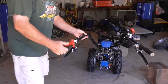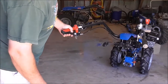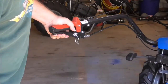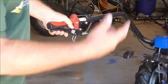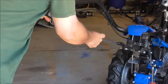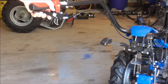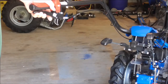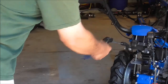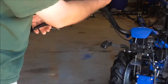Looking at some of the other controls — this is our clutch. In order to perform certain functions on your walk-behind tractor, you've got to utilize your clutch. Such functions would be changing your ground speeds. We have three ground speeds on this particular model. Some have two working speeds, some have three, some have four total speeds — just depends. If you want to shift gears with this machine running, change ground speeds, you've got to use your clutch. Pull your clutch lever in, change gears, get into the gear you want, ease your clutch back out and take off.